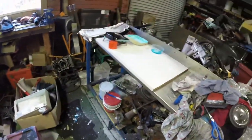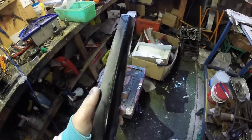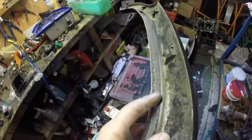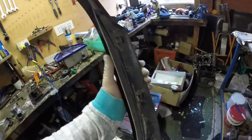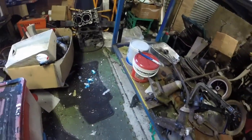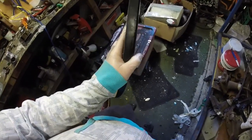While I'm waiting for the PVA to dry, I'll be working on my wide rear flares. What I've done here is stuck two together and then chopped the inside one out, so I've got a bit more room for the wheel. I'm going to sand it down a bit and fill it in with some plaster, then get some floor varnish to seal it, and then make a mould of it.